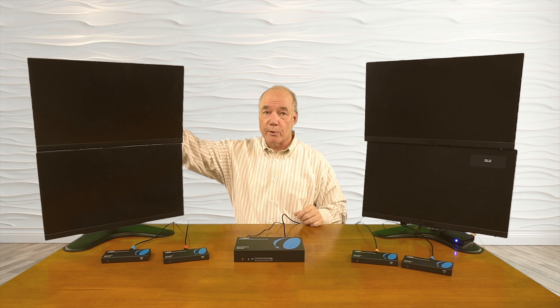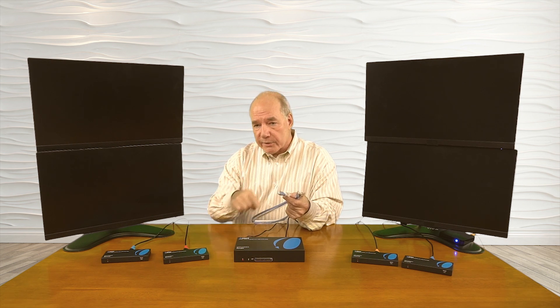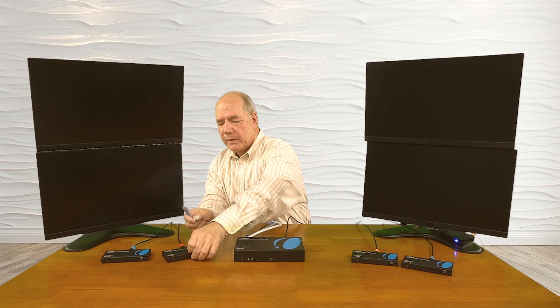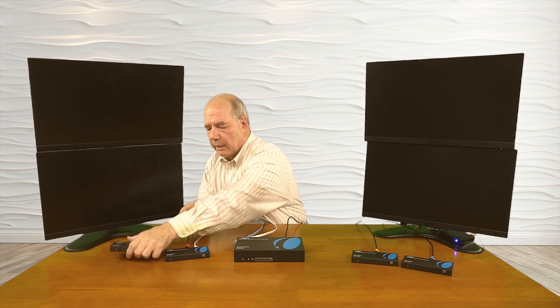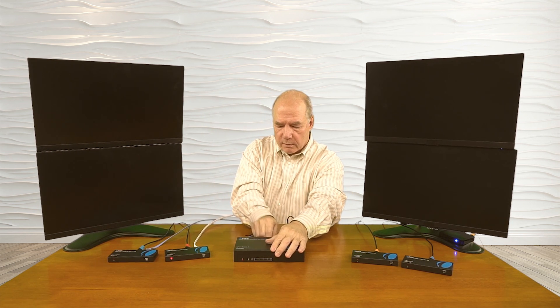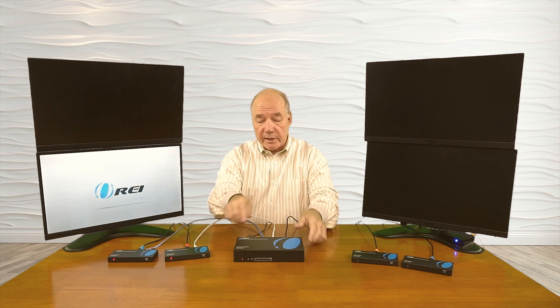Since I'm a little tight on space, I'm using a shorter cable just to simulate it. The minute I connect up the network cable between the sender and receiver modules, a couple of things are going to happen. The sender module will recognize that it's connected to a receiver module, send power over there to activate the module, and start a handshaking sequence for the network and video adjustments needed to send that media to it. I'll connect these to port one and two in the back of the sender module. Once negotiation finishes, the sender module will illuminate the first two LEDs, letting me know I've got a good network connection between modules one and two.